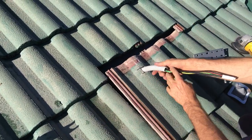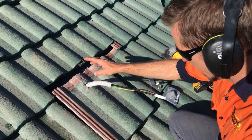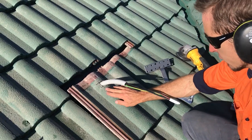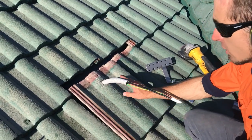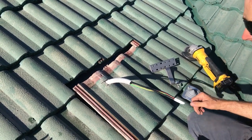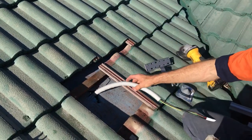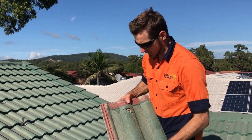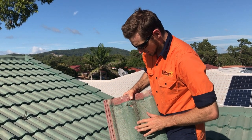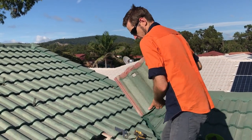That will allow our cable to come through. What I'm going to do is take this downstairs and wash it off so all the dust is off the tile, because I want to Sikaflex our deck tight onto it and we don't want any dust to stop the Sikaflex from really taking hold. We've ground this tile out, washed it down so there's no dust, and it's all dried off now, so we're going to install this tile now.